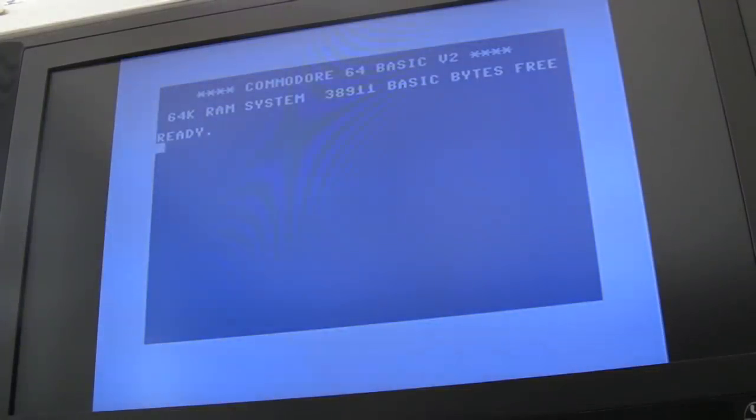I'm going to flow some solder on the top side to join it. Bear in mind that's the VCC pin on that ROM, so we could have killed it with latch-up. But the main thing is it's booting now. The reason it wasn't booting before is obviously because it had no power. The jumpers on that board are going to be configured to bypass the kernel, so the C64 was trying to address the ROM with no power to it.